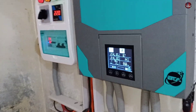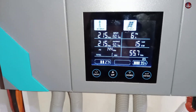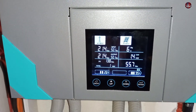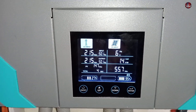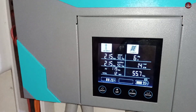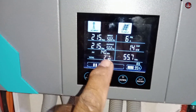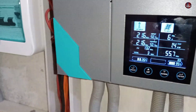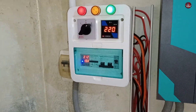The time right now is 5 o'clock in the afternoon and the sun is going to set. As I told you, at this time the performance goes down. We are just getting 1 watt from the solar panels. We are using 1.4 kilowatts right now. The battery is charging at 6 amperes. It is distributing the load to the home from the grid. The electric board I have installed will also be upgraded as it had a little problem with it.